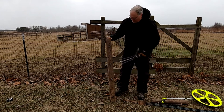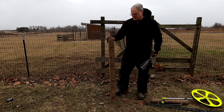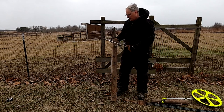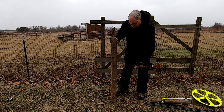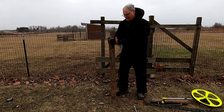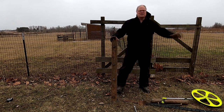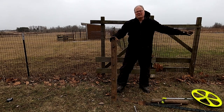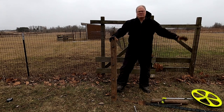So what you have to do is, I made this. This is a homemade fence stretcher. Just take the screws off, put the fence in between them, tighten them back up, and then the fence is caught between here. Put a chain around it, and then I used it for this. I think I used the truck because we didn't have a tractor at the time. So I used my pickup truck to stretch them.